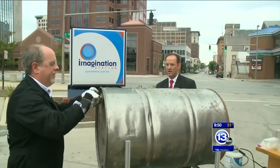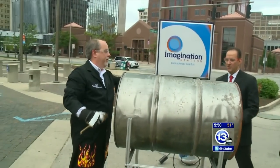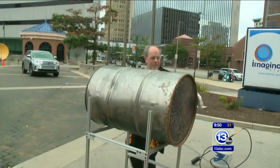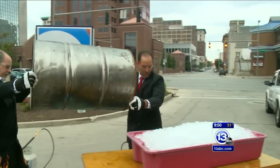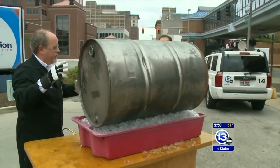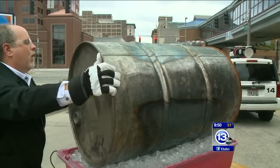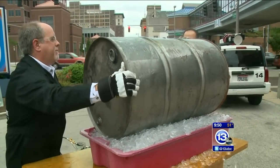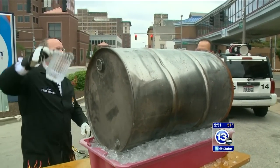Now hopefully we have enough of that hot air trapped inside there, because our next step is to take this barrel and cool it quickly on that tray of ice over there, Tony. Watch out for the liquid nitrogen — let's pull that down. We may have to resort to that to cool things down. Come on over here and pick it up, Tony. We're going to just put it right on the tray of ice. What we're hoping to hear are the ends popping in like a drum head. Go ahead and rotate it with me — we're going to want to try to cool everything down as much as we can, as quickly as we can. Get that water vapor inside to condense back into liquid and cool the air down inside. We might be able to help this out a little bit, Tony, with that pitcher of water — just pour it right on top. It's going to be a little messy.